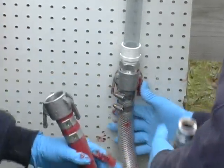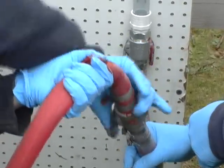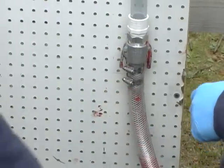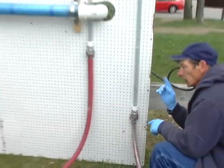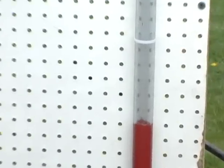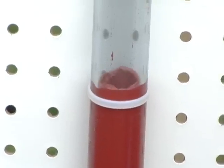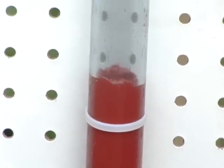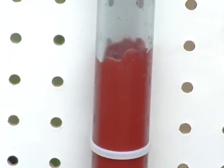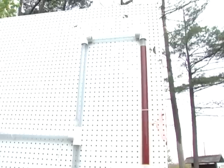This is a demonstration of the application of our red epoxy coating for potable water pipes, which meets NSF 61 standards for drinking water compatibility and is approved by the Massachusetts State Plumbing Board for all potable water delivery pipes. This epoxy can be used either on its own or with a liner. Here it is being introduced using a shoot tube to deliver a carefully measured amount of epoxy based on the size and length of the pipe to be coated.